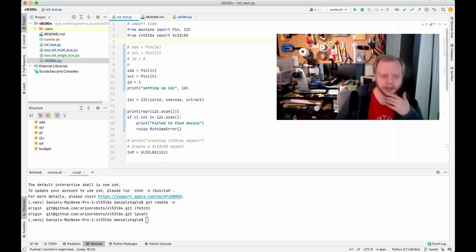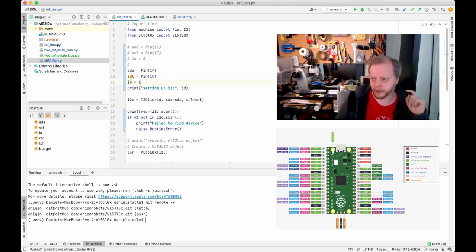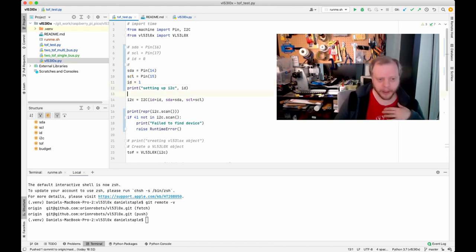The TOF test script drives the sensor — this is code Kevin originally wrote. I've named two buses on two different sets of pins. You can use different IO pins, just remember to refer back to that wiring diagram because it shows what pins are connected to which bus. You can't reverse SDA and SCL — they're fixed, although there are many groups of pins on each bus. I've also got a print function in there to help with debugging. One of the first things that went wrong was I didn't know about the X-SHUT pin.